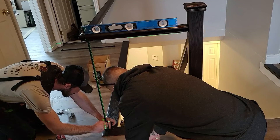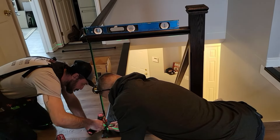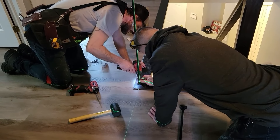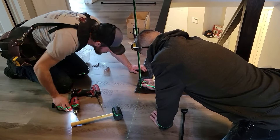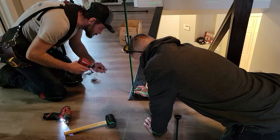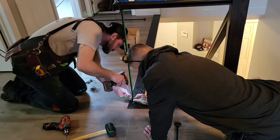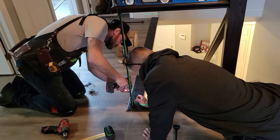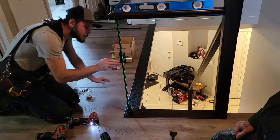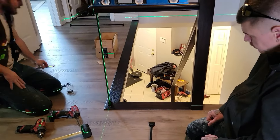Once we have ourselves into place, we're going to make sure that our second person is holding it into place. Then we're going to get started on the exact same process — pre-drilling those holes to make sure it's going in perfectly for a nice tight fit. The bottom plate here has been replaced and stained to the dark color our customers have chosen, so it doesn't have any holes or filling from the previous railing. We are drilling those holes and getting those screws down into place. In this job we had 65 balusters to put in, but that first one along each line is the most important — then it's the same process. Double checking our vertical now that we have it in place, and then we'll get our next one started.